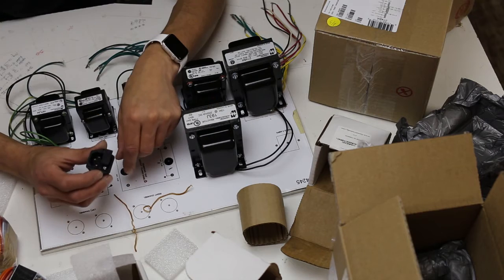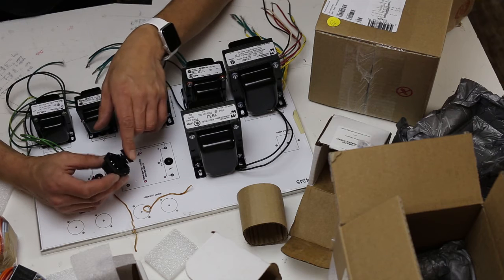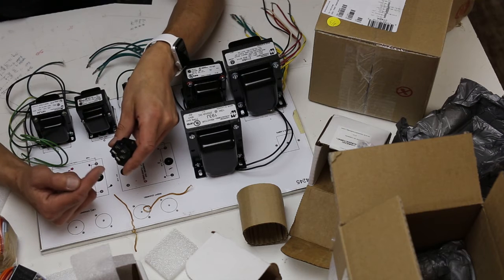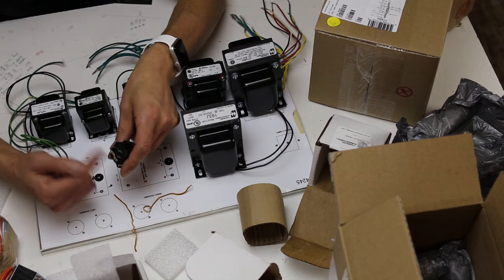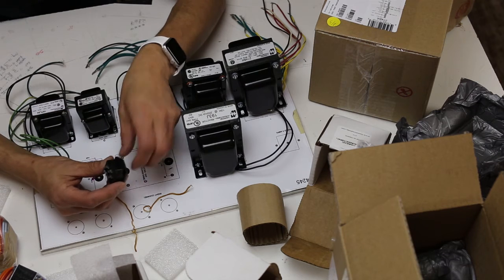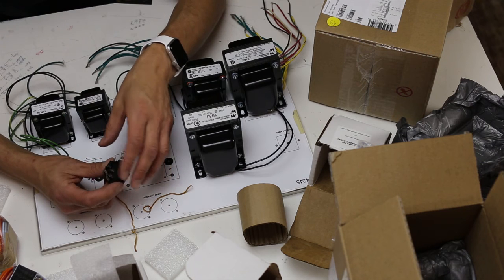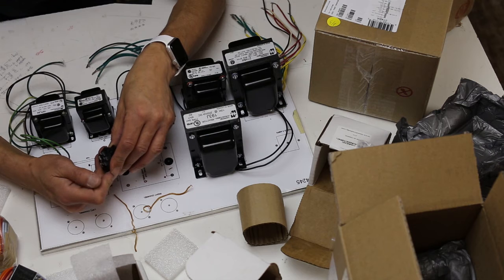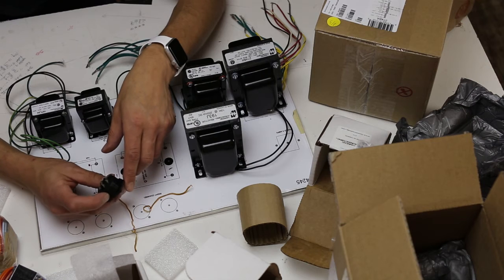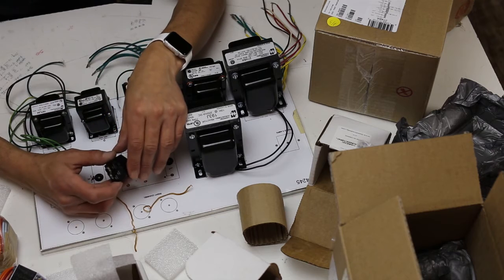The IEC socket like this one has the fuse door here and a spot for an extra fuse. I'm going to take a good minute to tell you how to wire this properly. I've seen people do some really bad things — like running a little wire to ground or lifting the ground because of noise. Don't ever do that. I'll have a video on wiring this up properly.